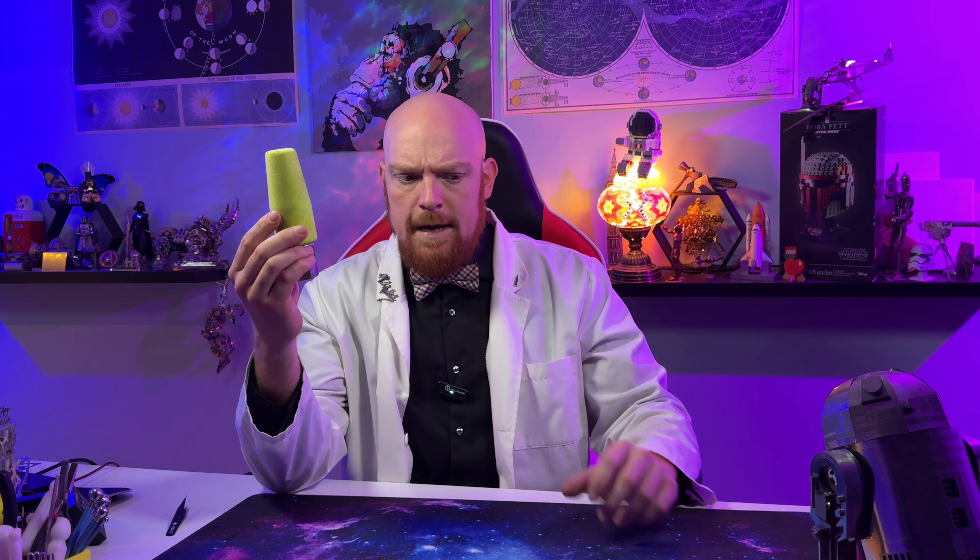When the Dig Pig Silencer showed up at my door for the first time, I was extremely excited to attach it to the end of my wand. I was immediately impressed by the amount of strength that came out of it, and I had to go back and actually turn down the water to find the optimum pressure. When I found that it was about 1,600 to 1,800, I really couldn't believe it — most tips definitely need to be in that 2,800 range to do any kind of damage to the ground. The significantly less vibrations I was feeling in the wand was a big relief, as that is one of the biggest complaints hydrovackers have — hands become numb after a while. This has significantly less fatigue for the operator, and with its solid construction, you're going to be using significantly less refresher kits than other ones in the industry.